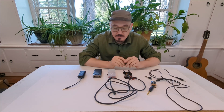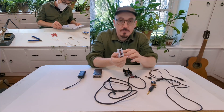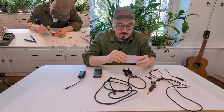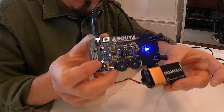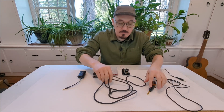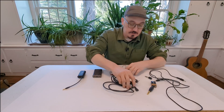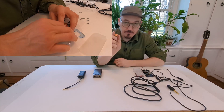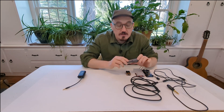Here are the basic elements you need for this project. We have your electromagnetic wave sniffer, which is two inductors plus an op-amp chip that's going to amplify the electromagnetic waves it's picking up. I have this more complex version from Italy called Nascuda — it has a frequency adjustment and volume adjustment built into it. And then I have a really basic one, which is just two inductive elements with a headphone jack out. They both run on a 9-volt battery system, and you'll need a 9-volt battery.